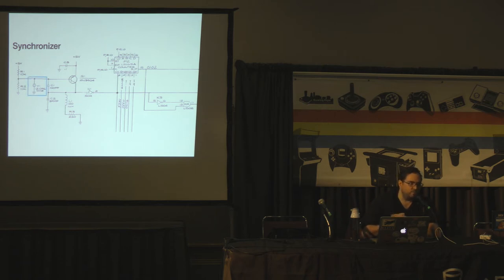Y1 is our 12-megahertz crystal. That sinks the line a little bit at a 12-megahertz interval, then goes into Q1 which brings it up to TTL levels, then into the N1 not gate. That produces a nice square wave — your crystal gives you sort of a dirty sine wave and you boost that up so it hits TTL levels. A lot of people get tripped up because Y1 does not output a TTL signal, so you can't measure it with a logic probe. If you want to measure that, you need to use a scope or measure it on the TTL chip in order to read it with a logic probe.